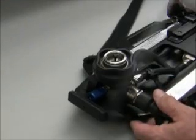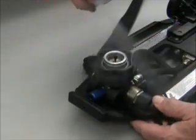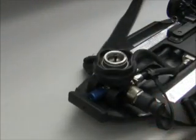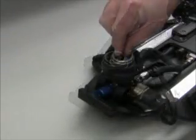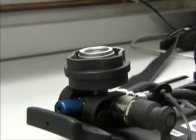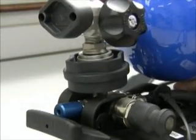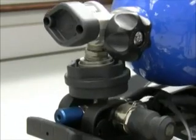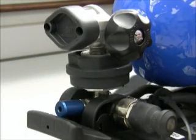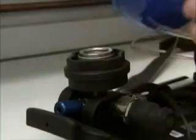Now spray MS122AD dry lubricant on all metal surfaces, especially on all moving parts of the coupling where there is metal-on-metal contact. Allow a few minutes to dry before removing the blanking plug. When connecting the cylinder, push the cylinder adapter into the quick cylinder connector system until a positive click is heard. The hand grip will rapidly rotate approximately 45 degrees counter-clockwise, indicating that the valve is correctly connected to the first stage pressure reducer.